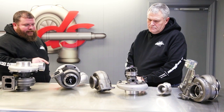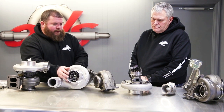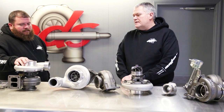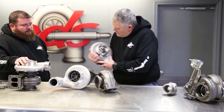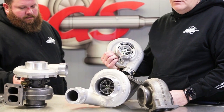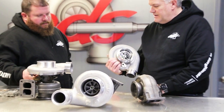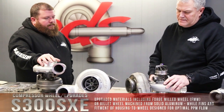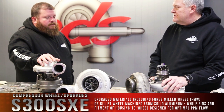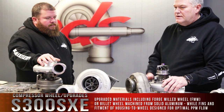Tell me what's different about the compressor wheel in the SXE versus the John Deere turbos we've always known. The biggest difference you'll see is the material and how they're manufactured. But the design of the fins, the design of the back of the wheel — which you can't see with the housing installed — and the fitment of the housing to wheel have also been changed by Borg Warner engineers to get optimal flow out of this versus that housing there. They went to the machine-from-solid design to give it more ability to withstand higher pressures. The difference in the fin design is helping the flow in the pounds per minute that this thing can produce versus the original.